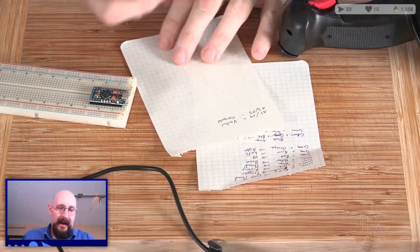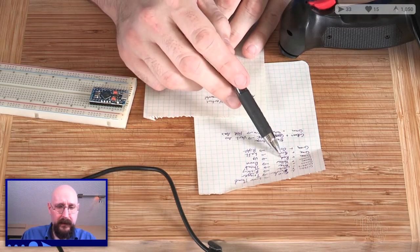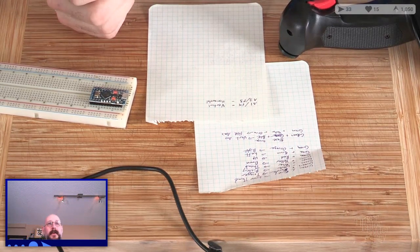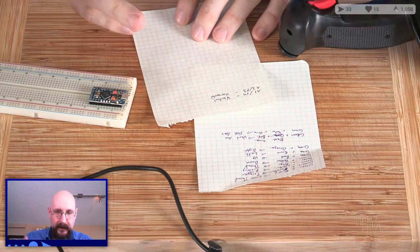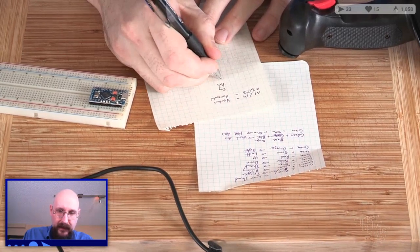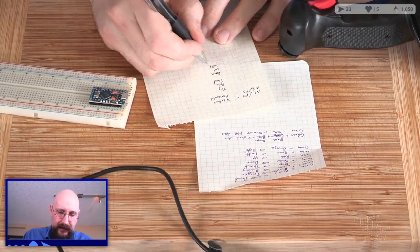God damn it, Ian. Okay, so we're going to be using A2 and A... those two, and then button matrix the rest of them down there. So a total of 1, 2, 3, 4, 5, 6, 7, 8 buttons. We could probably get by with a 3x3 grid, to be honest. Why go any farther than that? So we need trigger, we need pinky, we need thumb, and then we need down, up, left, and right.